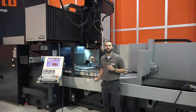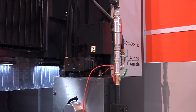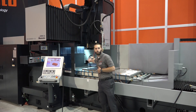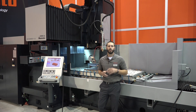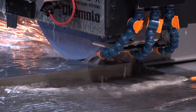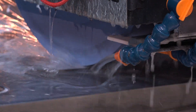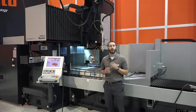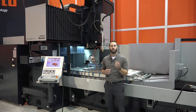The IQ has an option which I must stress is very important: our BICS system. The BICS system encompasses our high productivity coolant supply unit as well as our 3M Cubitron 2 wheel. This is going to allow you to take a whopping 4 thou infeed cut, opposed to the 1.5 thou. We have designed a product that is going to aerate the coolant much better going towards the wheel and keep those pores cleaner, thus allowing you to take a more aggressive cut.